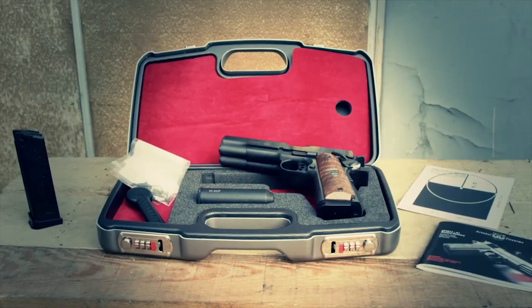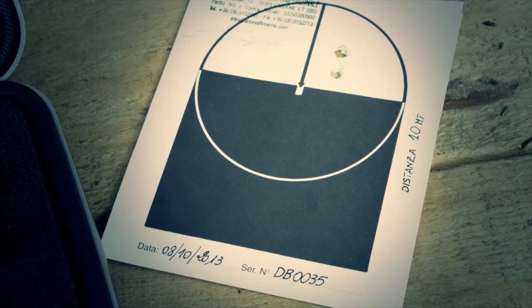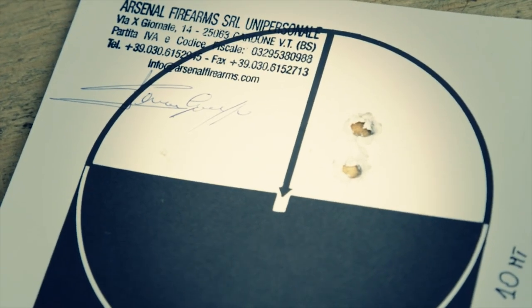Very acceptable for two barrels. Since the ammunition that people are going to shoot is kind of beyond your control, you have to do the best you can here to make sure mechanically all the components are as near identical as possible. What we are doing is proofing at the proof house each gun with a certificate, and we are also doing a test target sealed and signed with date of each serial number, included in the box as total proof of how the gun shoots with the standard specified ammunition.